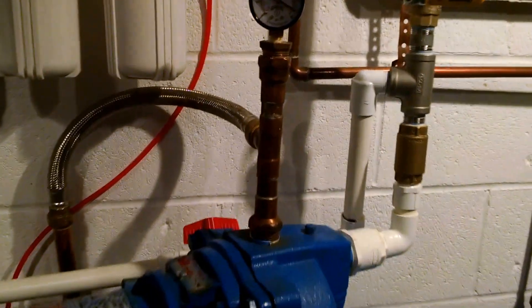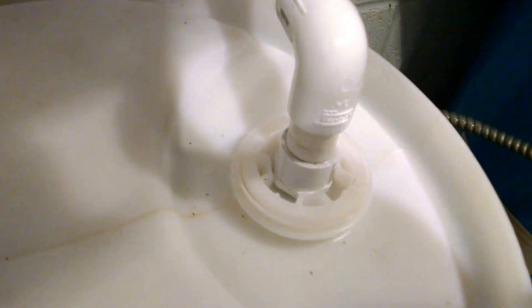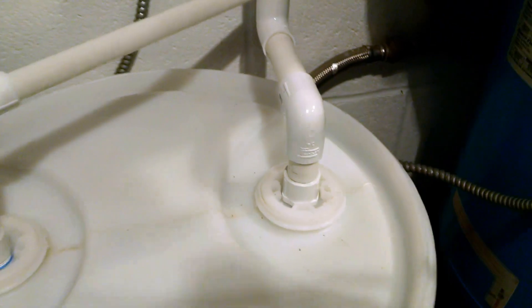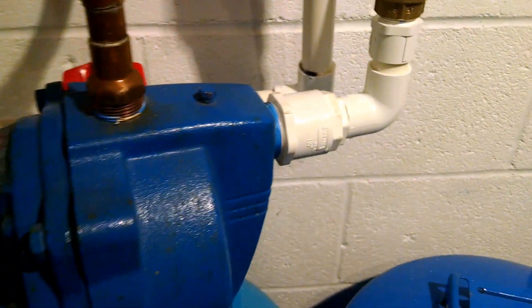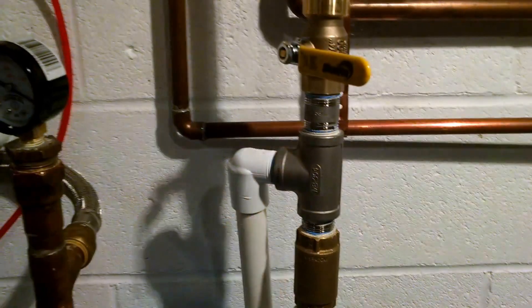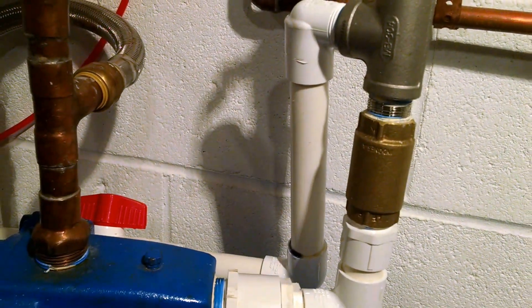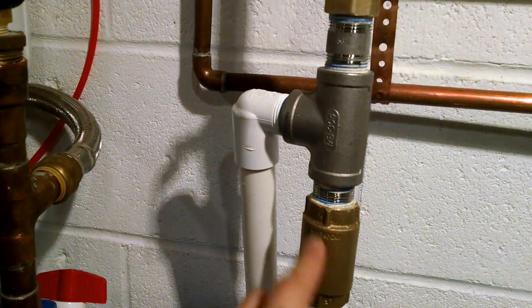If you guys have any questions about any of the parts I used, feel free to post some comments. If you have any suggestions — maybe there was a fitting I could have used to achieve this without having to machine the parts myself — I'm not sure. But I tested it and it works. I was able to just close this valve, open this valve, and now this system is sucking from the waste barrel. And if I close this valve and open that one, then I can pull pressure from the rain barrel. Either way, this check valve holds all the pressure inside this pump. You have your switches after your check valve, so the check valve is serving both sides.